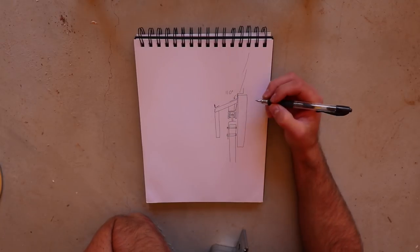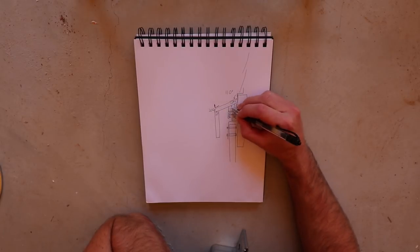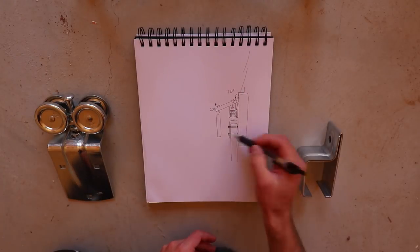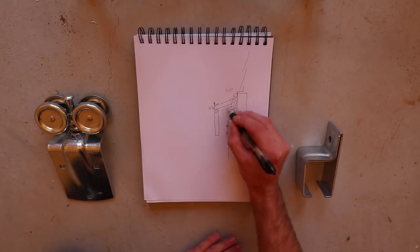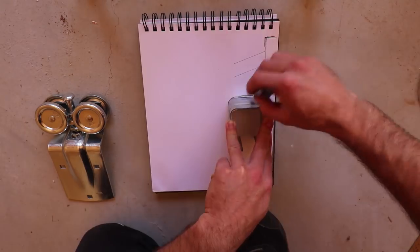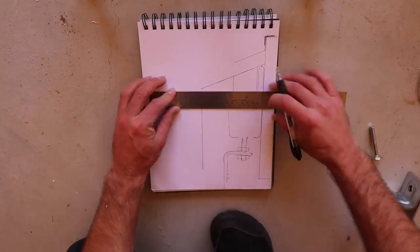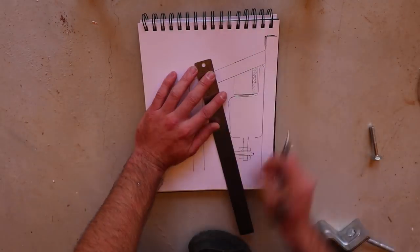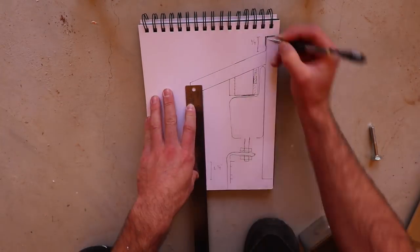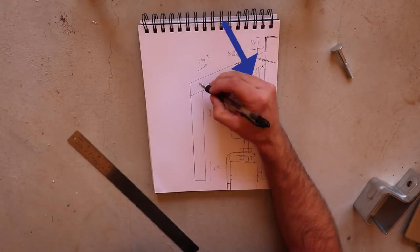Connected to the top will be a front face piece. This design will prevent any water from going up and over the top of the door, keeping the inside of the workshop dry. The top piece needs some support, so I'll add a 2x4 supporting rail above the track. I first did a quick sketch to make sure I had everything included, then flipped the page to make a drawing to scale. I used a ruler and protractor to get the measurements and angles just right, and used a bracket and trolley to outline their pieces accurately. I needed to adjust the location of the support rail because of the bolt that connects the bracket to the wall.